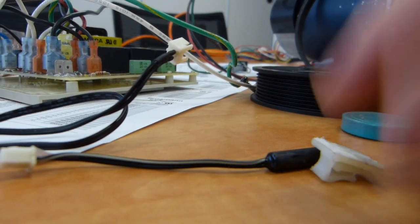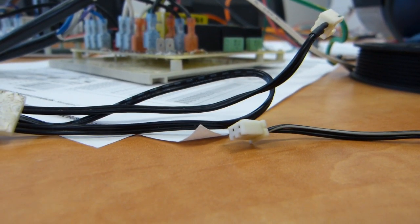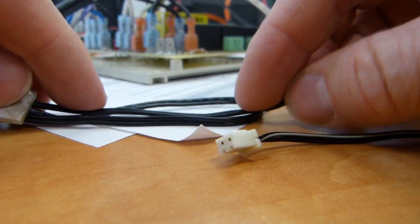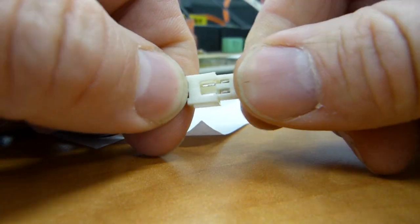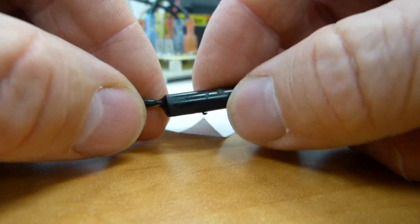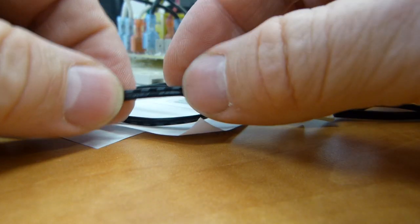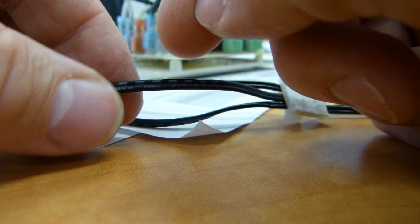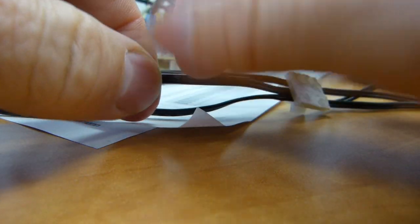Because the magnetic field moves some electrons in the wire, this is very low voltage, very low amperage wire, and a very skinny 24 wire gauge. That also means that these points are not a potential for electrocution, or an electrical hazard. Even if the wire coils are exposed here, they are not a source of electrical hazard whatsoever because of the extremely low voltage. So if the wire is torn, it can be safely just twisted back together and left out there for the elements, or okay, maybe for due diligence, why not put some electrical tape on it. The wire can be repaired if it's torn with just electrical tape and twisting it together.